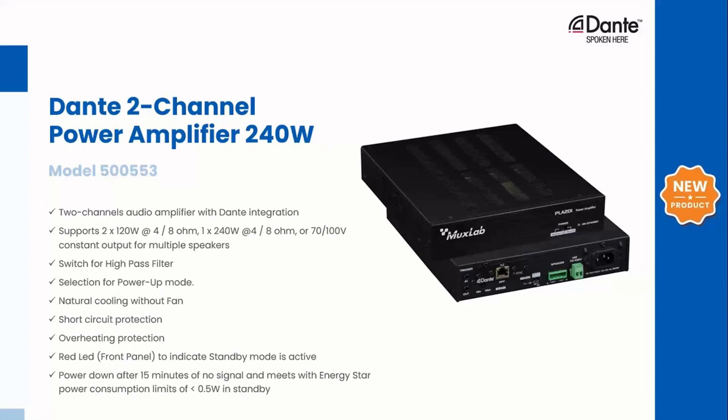It's a 240 watt amplifier. It can be used as a single channel output at 240 watts or in stereo at 120 watts per channel. In stereo mode, you can support 4 ohm and 8 ohm speakers, as well as in mono mode, you can support a 70/100 volt speaker system.